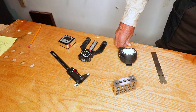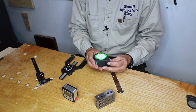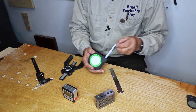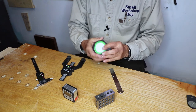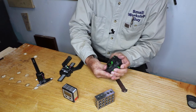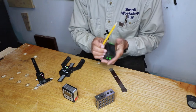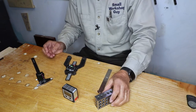Six very handy measuring devices for your workshop. As far as the tape measure you should get, I recommend the FastCap Lefty Righty. It has a pressure plate on the bottom so you can pull it out and hold it, let it go — most of them don't have that. You can write on the surface, it's got all the regular stuff, it's also got a clip you can open to get it on your pants easier, and it's got a pencil sharpener built in.